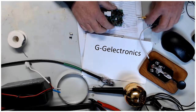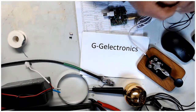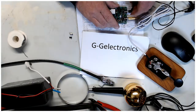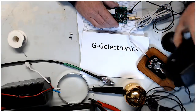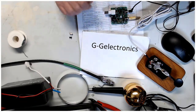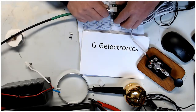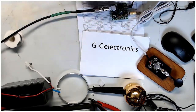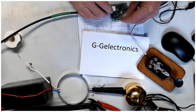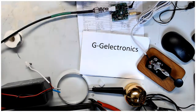So I've got a key. I'm going to pop the key in there. I've got a pair of low-impedance headphones. You can use powered speakers if you need to, but I just use these. Low-impedance is all you need. Let's pop on an antenna. Let's pop in a crystal — this is a 7.023. Pop that right in that crystal seat that I installed in there.